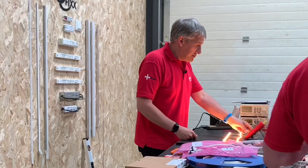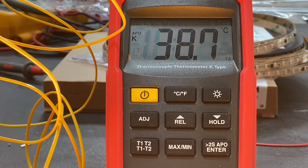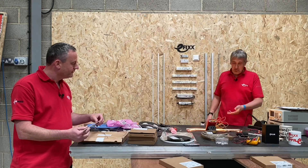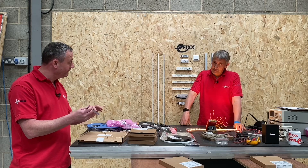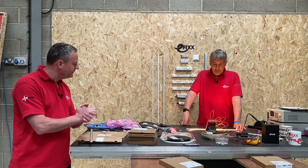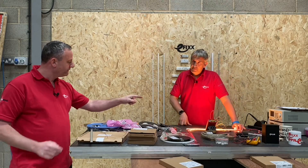So comparing the two strips, clicking the button on the meter shows there's getting on for 17 to 18 degrees difference between them. The one in the aluminium profile is sitting at about 38 degrees — so the profile acts as a heatsink. That's a great reason to install LED tape in extrusion, not only for temperature management but for other reasons we'll explore too. It's worth noting that free air isn't really a typical installation scenario — more often it'll be stuck to a surface.